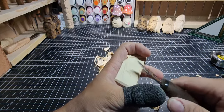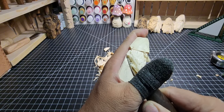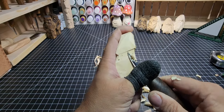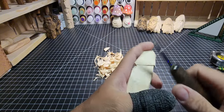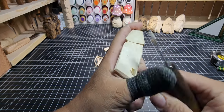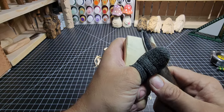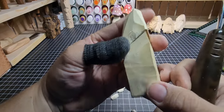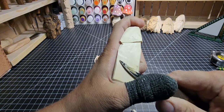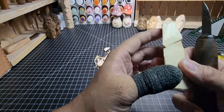I started carving in and the grain started pulling the knife deeper, so carving downward here wasn't the right move. We're going to carve the opposite direction. Pay attention to your wood — your wood will tell you how to carve it. The grain runs vertically on this piece, and if you carve between the grains it pulls the knife deeper. We want to cut through the grain, not between it. Keep peeling it off this way a little bit at a time until it's clean.